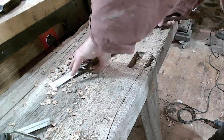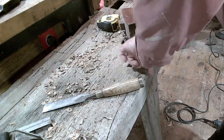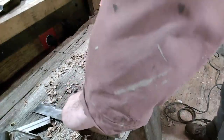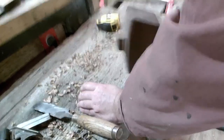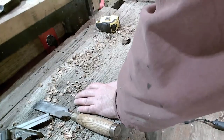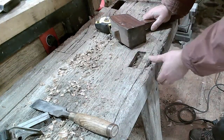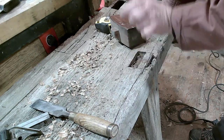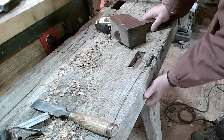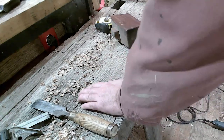See, the pressure's actually on that side here. It's not going to come flush. What I can actually do here, if I wanted to, on this bit here, I'll get another bit of end grain and you can make a plug that fits in the hole. So once I wedge this into place, I know it's not going to go anywhere. Because this isn't going to go all the way up, because the main leg's too short. It's going to come up a little bit more. Or is it there now? No, another 10 millimetres that'll come up. But if I want to make a nicer top to it, I'll just use a bit of end grain if I wanted to.